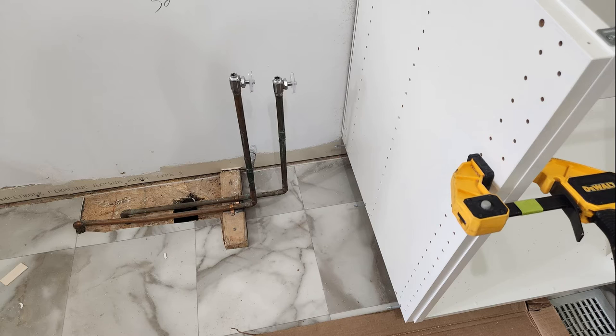I don't assemble the cabinet and cut out, because quite often you have pipes coming in more than one direction and that means that you cannot cut out the cabinet and then get it into place. So I have to build the cabinet around the pipes.